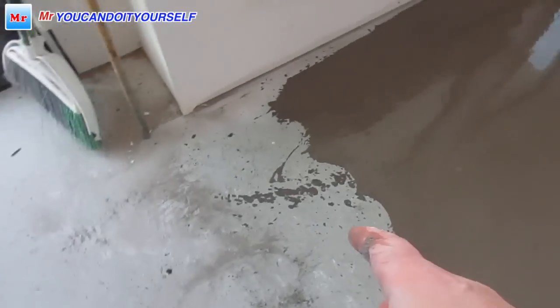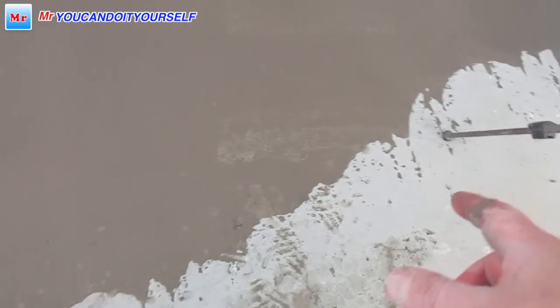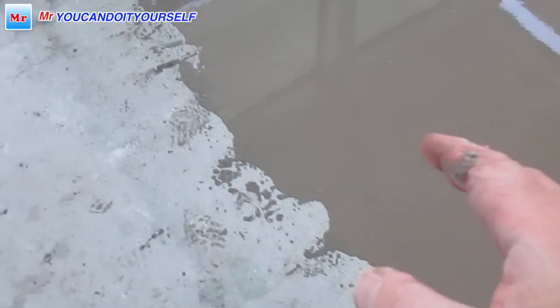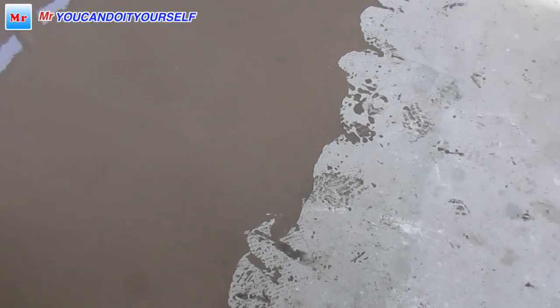so these edges, some subscribers asked me about edges, what we can do with edges. So I want to wait until it gets more solid, and then I take a sponge, a wet sponge, and make it nice and smooth. Otherwise, when it's completely dry, you can take a grinder and make it smooth with the grinder. But most of you don't have a grinder, you can do it with a sponge. Okay, so let's wait for half an hour.